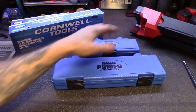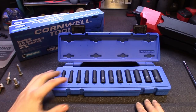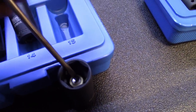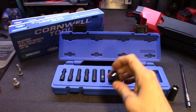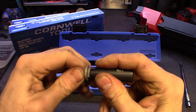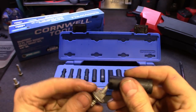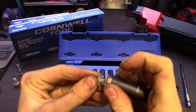This is actually my first set of magnetic sockets I've ever gotten. Getting over to the deeps — same set, same 12 pieces, 5 to 15mm. These ones are spring-loaded. What I mean by that is the magnet inside is on a spring. You can push it down. When you're using it on fasteners, putting a nut on and things like that, you can push past it to where you're able to get on it and spin it. It won't push all the way through, but about that deep. It's spring-loaded and still holds the fastener, so when you go to turn a nut out of there, it'll grab hold of the nut and keep it with the socket.